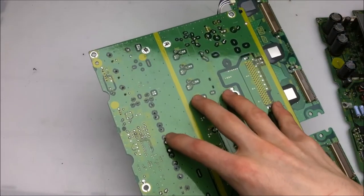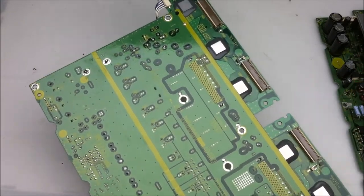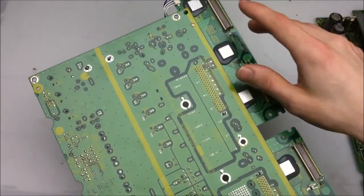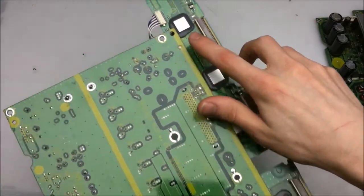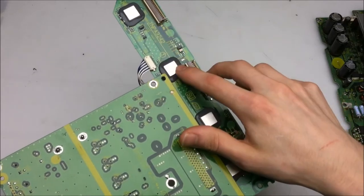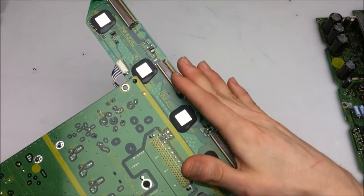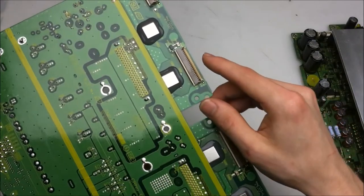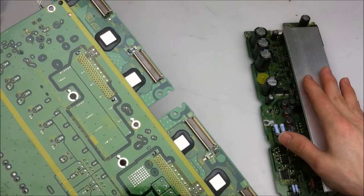This board pretty much handles the high voltage switching and the PWM frequencies and stuff like the brightness of the actual display. Whereas these chips control the actual lines. So there are data line inputs here, and these chips take and put out each individual line control command. So these are all out and these are all in. You have to treat each one of these as like an anode, and then this is a return cathode.